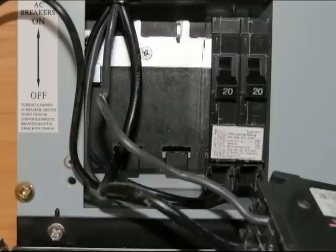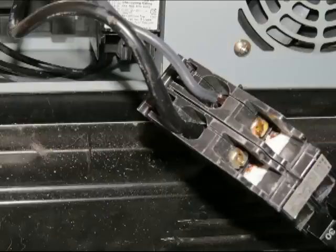If you look closely, you'll notice one wire is a little thicker than the others, and that's your 30 amp wire coming in from your shore power. It's the feeder line that feeds all the breakers, and that comes out from the 30 amp power cord. And here's a better picture. You can kind of really see the difference in the wire sizes side by side.